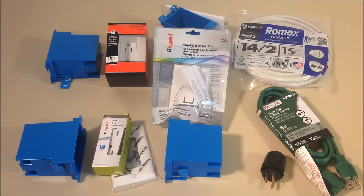Immediately to the right on the top is a recessed electrical receptacle — that's how you'd plug your television in to get power behind your TV. Below it is another receptacle — that's how you're ultimately going to get power up to the TV. Sliding over more toward the center of your screen, you see the third and fourth blue old work electrical boxes, and then in the middle, that Legrand clear package — that's how you decoratively conceal the wires as they enter the wall to go up to the television. At the top, you can use one or two of these — one at the top, one at the bottom — or you can use a regular Decora trim plate at the top because the TV conceals it anyway.